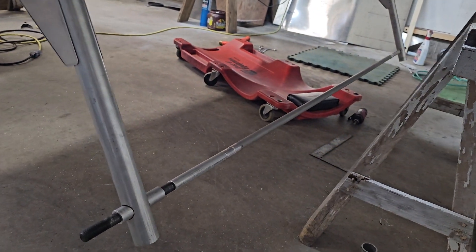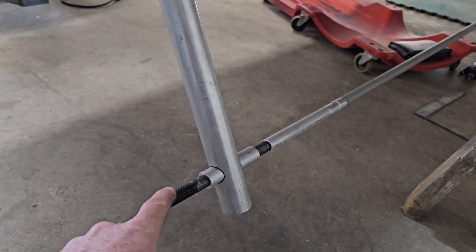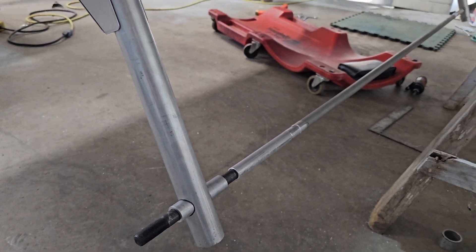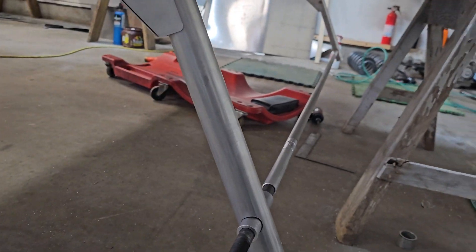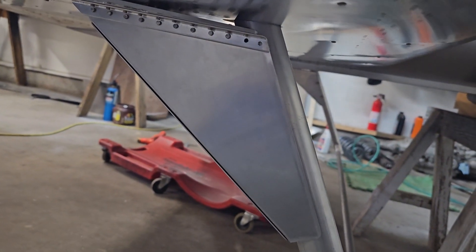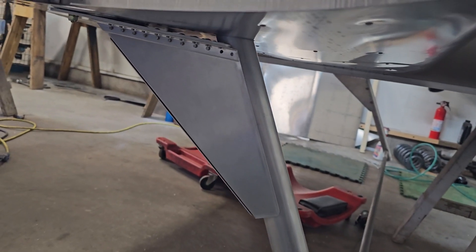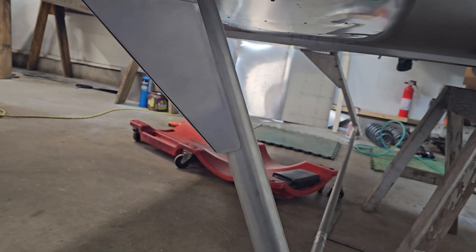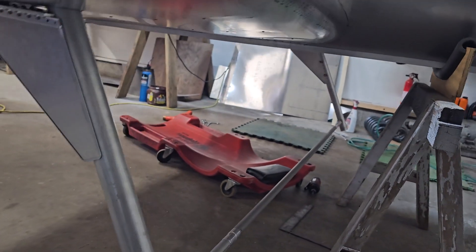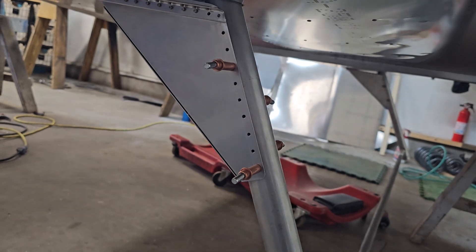Cobbled up a straight piece of tubing out of stuff I had laying around — machined these spacers, put those in there. This is the little axle I'll be using, got one on each side, and look at that — it's nice and straight across, lined up right where it should be. Going to drill and cleco the gussets onto the strut tube and then weld those in. Got that section drilled and clecoed.